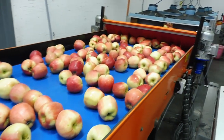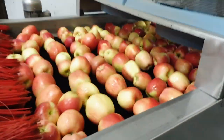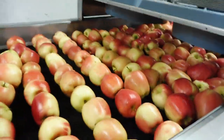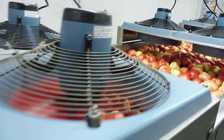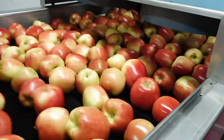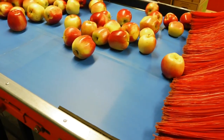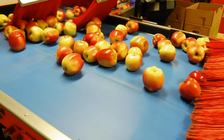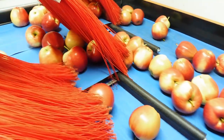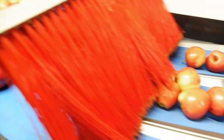The good apples are sent down a conveyor belt to the scrubbing and drying section. You can see a set of rollers — even-numbered rollers connected to one motor and odd-numbered rollers to another, running at different speeds — which scrubs the apples while moving them forward. As they move forward they pass under a set of fans for drying. The dried apples then go onto a step conveyor where they're turned 90 degrees and set into single file using V-belts running at different speeds.